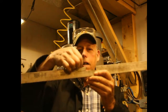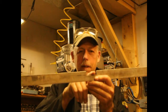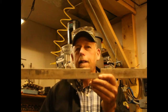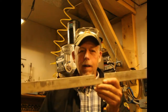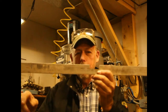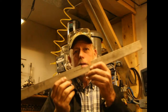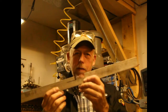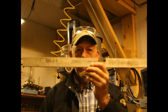All it is: there's a slot cut here just a little bigger than the blade, a place here for the blade to come down in, then slide in with a couple of set screws to hold it. The biggest problem is this slot has to be perfectly perpendicular to the bottom. When you tighten the blade down onto it, it will show you whether it's canted to the front or the back. Mine was a little canted, so it would dive down and come back up repeatedly. This simple tool fixed that.